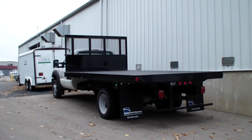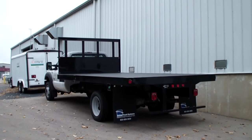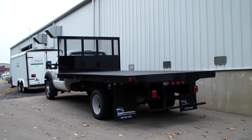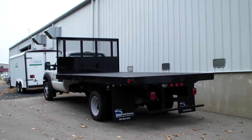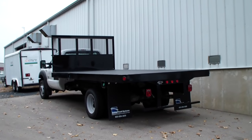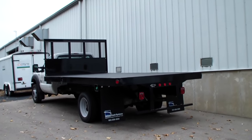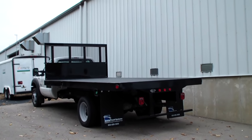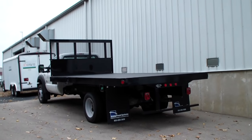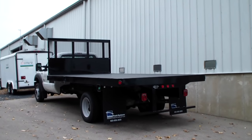This is actually an F550 flatbed with a 16-foot by 8-foot bed. It's going to have an amazing package — not only the 31 horsepower, 3,500 PSI at 9 gallon stainless steel hot water machine, but also a soft wash system with two 55-gallon tanks. This one's going to have two 200-gallon tanks and an oversized hopper wastewater recovery and filtration system.